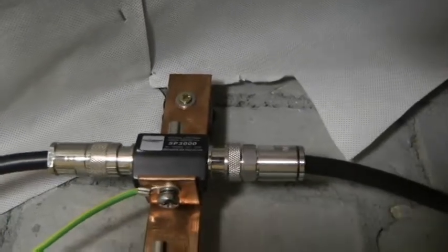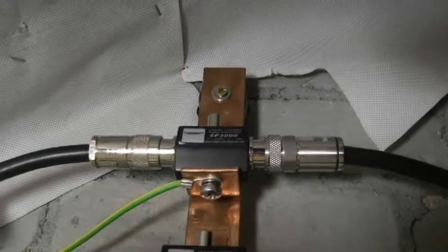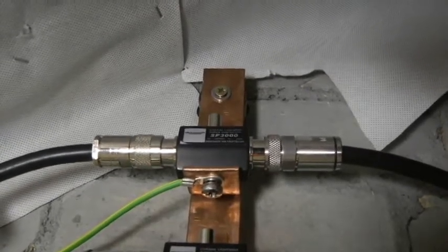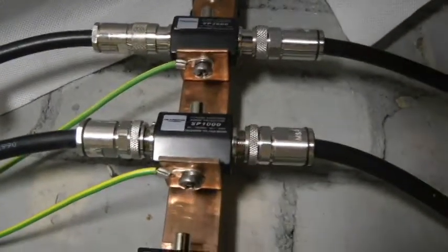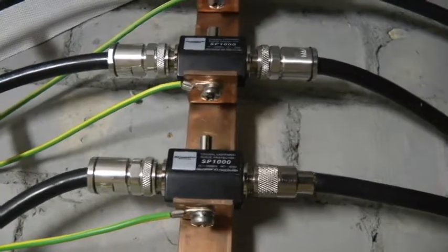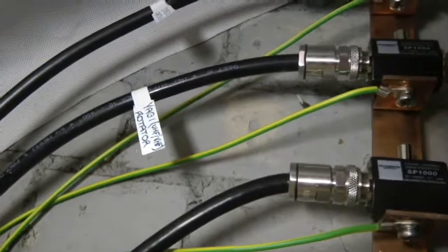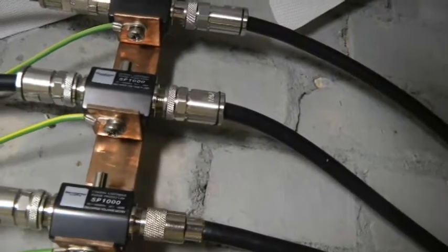The lightning arresters are mounted up. The top one is for the discone antenna for my SDR radio. The next one down is from the Yagi antenna on my rotator, and then this one is the end-fed antenna. I'm quite an organized person — you can see I've got them all labeled. The feeds on the left are coming in directly from the antennas, and the ones on the right are patch cables about two meters long going off to the desk for the various radios.